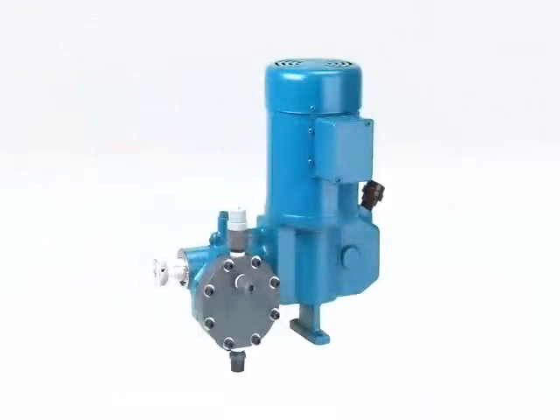This same technology has been adapted to the Neptune series 500 pumps with PVC heads. You may specify the air release features on any series 500E PVC pump up to nine gallons per hour. Pumps with larger flow rates tend not to require gas release valves, as the higher volume per stroke purges accumulated air naturally.